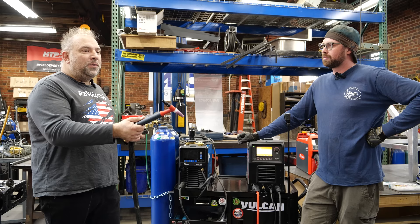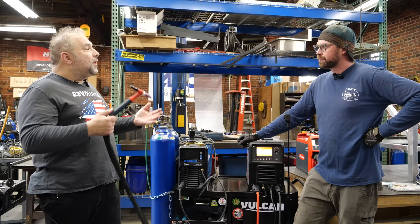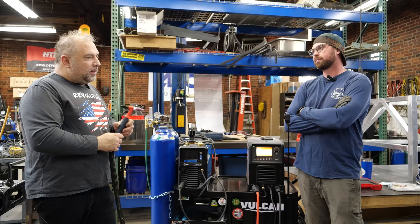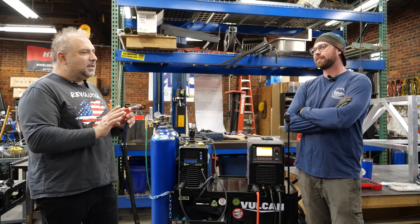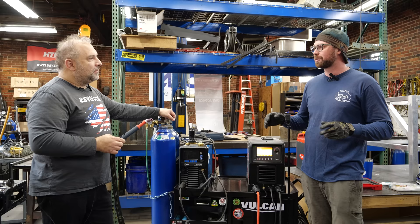If you do regular household stuff — 100, 150 amps — you don't need any longer post flow than on a regular torch. But if you go 200, 250 amps and you really want to extend the life of your torch, that's always a good idea. The theory I was told 25 to 28 years ago when I started welding is: don't have too much gas — there's a vortex and it's coming out and sucking ambient air in. I've heard similar things, specifically regarding aluminum. I've heard that too much gas flow welding aluminum with a standard cup can create arc instabilities. Is there any credence to that? I don't know.